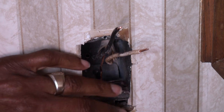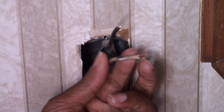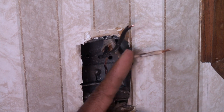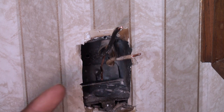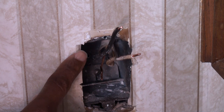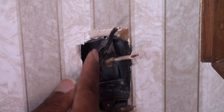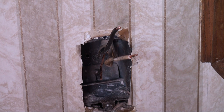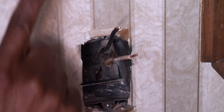The power is at the fan, which is why you don't have a common wire coming out here. The common would be the white wire. There is a white wire there, but the way this is wired, the white wire is not a common. We have one wire coming in which is hot, another one going to the fan, and the other one is ground. We've got to figure out which of these two wires is actually going to the fan.